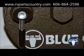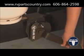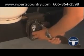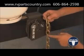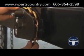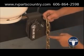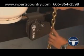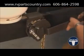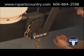Release the rotating latch bracket by rotating the lock pin. Rotate the bracket using the wrench provided and turn clockwise until the chain slot is on the bottom. Insert the chain with the desired chain link in the slot of the tightener. In this video, we will start at chain length 7; we recommend starting at chain length 4 and adjusting as necessary. Using the wrench, rotate the bracket counter-clockwise until the latch pin engages in the latch hole.